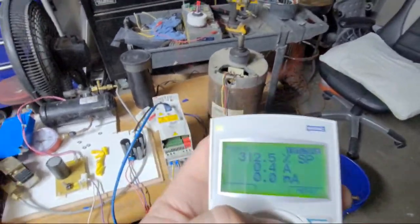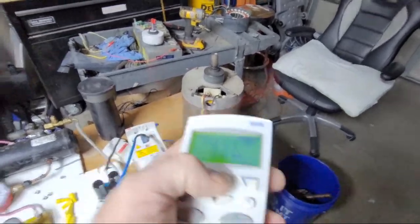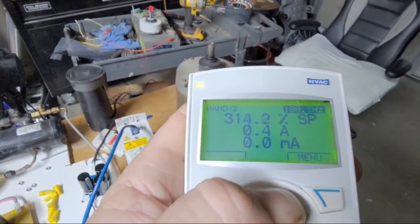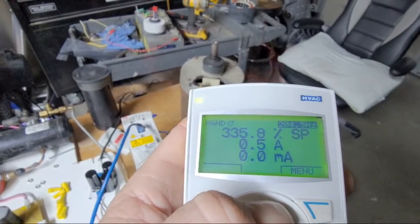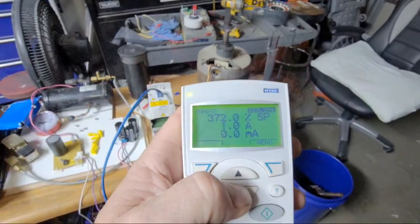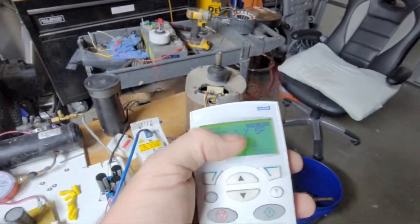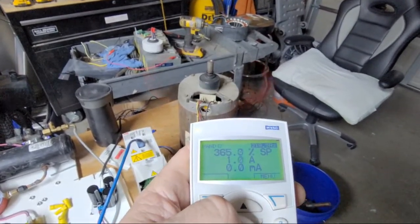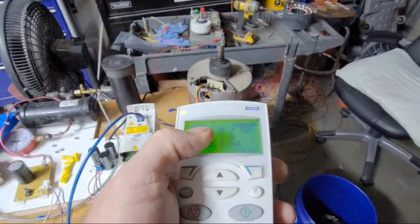But watch what happens if I keep going faster. I don't think the VFD screws up at all. I think the motor actually just loses sync, because AC motors just have slip in their nature. And of course, we're not driving the voltage up any higher like you normally would need to when you overspeed a motor with a load on it. There's 200. Oh, they just wigged out. See that? 223. I think the rotating field is still going that fast, but the motor just loses sync because of the voltage versus frequency. Even though there isn't a load, it wigged out. If there was a load, we would get nowhere near this.